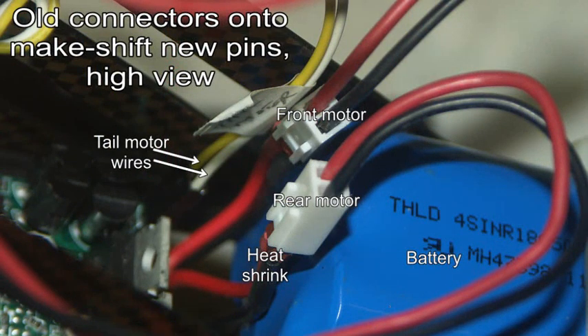Finally, just one other view from the side and above showing these connectors put together. It's hard to see every detail, but hopefully the cumulative effect of the pictures will give enough idea of what you've got to do. Take care with polarity and insulation. The driver transistors are controlling the main motors on the negative leads. If you use flying leads and pins or other connectors, make sure your wire is rated sufficiently — the current consumption isn't particularly high, but don't use wire that's too skinny or it might overheat.